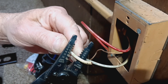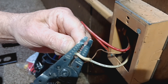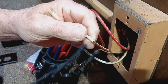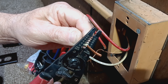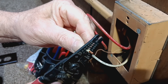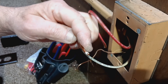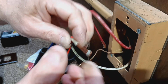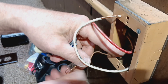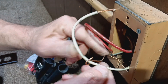I'll strip what I need with my strippers using our number 12 hole. I'll pull our insulation off and take a very small piece, bring it up to the top very carefully, just leave it up. Bring it up by the top like that. I'll twist my strands together and put my ground wire down towards the bottom of the box so it stays out of the way.